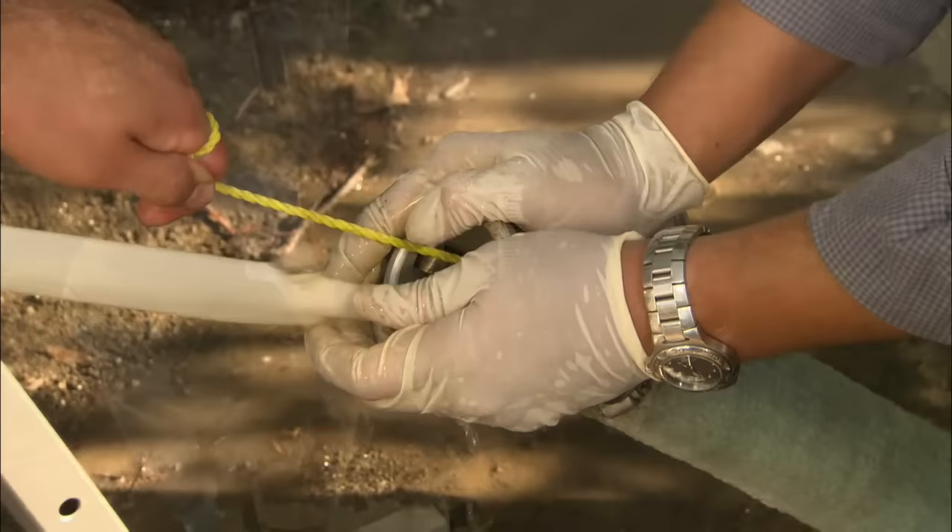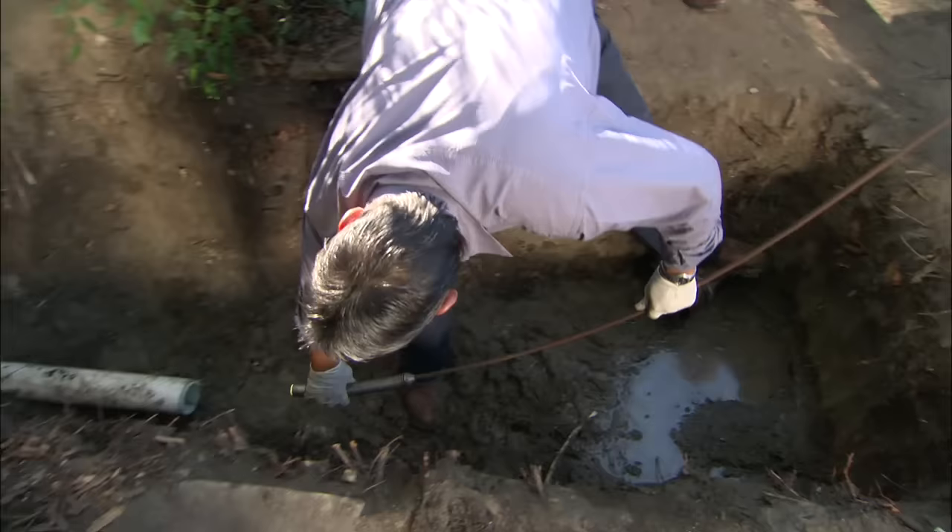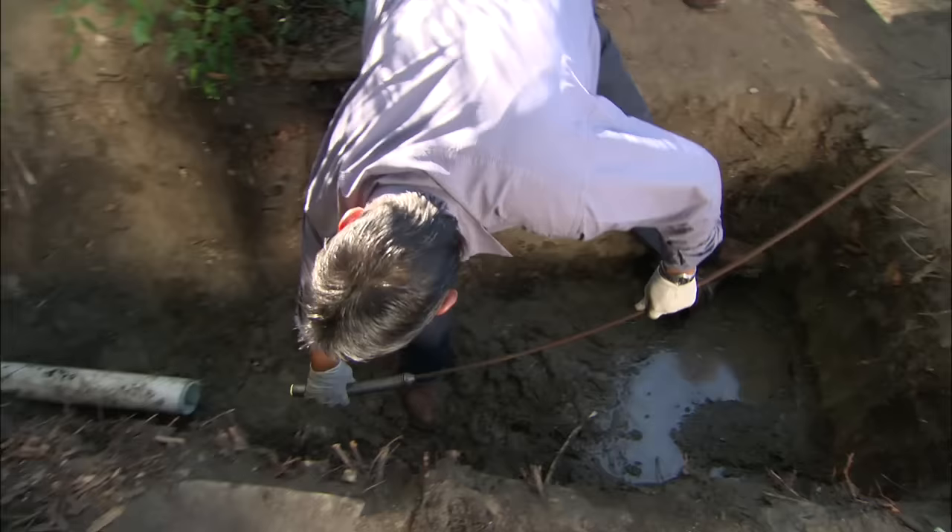Is it a pipe yet? Yes, it is — it's hard and it's ready to go. Now I'm going to loosen the clamps, drain the water out, and pull the bladder straight out. Patrick, are you ready to visit your new pipe? We're using that same video camera down into that new liner — and look at that: perfectly smooth all the way along. That's fantastic. You now have a continuous line inside that old line. No more tree roots.